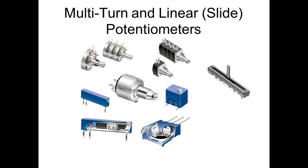Now we have different position sensors, right? You understand that. But both lines have a potentiometer position sensor. Both of them use these linear pots. Now these guys, the transfer function is going to be so many volts per inch or something like that, right? Over here we use inches or whatever. And that would be the way we calculate transfer function.